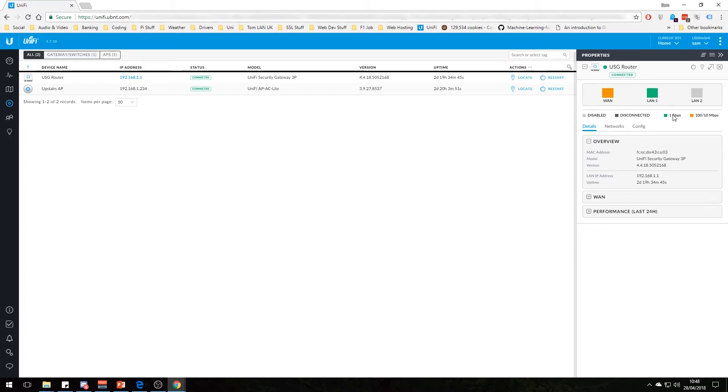The LAN1 port is labeled as gigabit because it's gigabit capable and I have a gigabit switch, which is why it shows up as green. There are two others — LAN2 shows as disabled, and I'm not sure if it's even implemented yet in the USG — it might be there for future expansion. Basically everything you want to check about a device in UniFi, once you click it, will show up in a little pop-up along the side. You can view its overview, WAN, and performance.